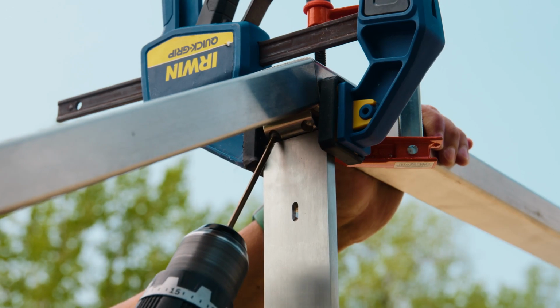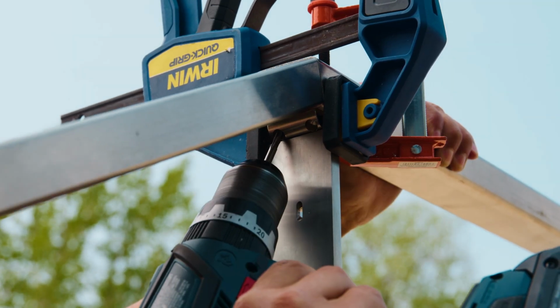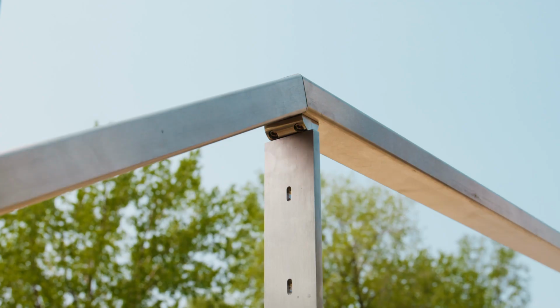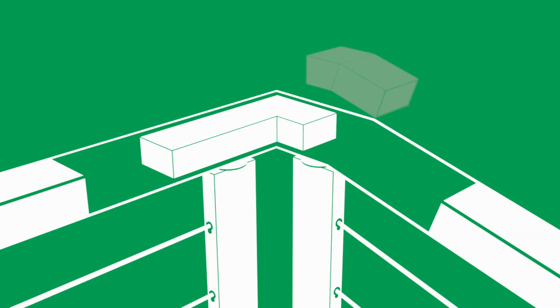Because of how this handrail comes together with our Delrin splines, we need to assemble everything before drilling any of our post top holes. When we are ready, we'll attach our post tops through our splines. If we were in a position where we had a corner joint that just turned either up or down stairs, we would then need to cut our corner spline short to make room for the custom spline that holds the vertical joint together. And there you have it.